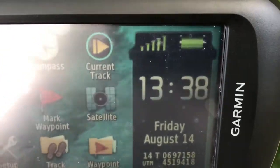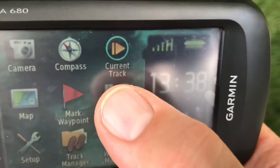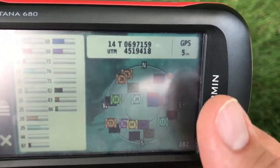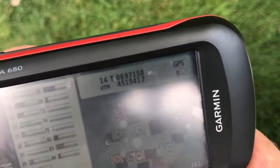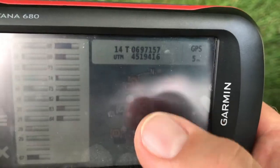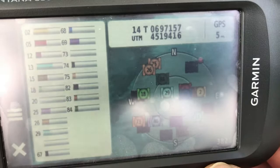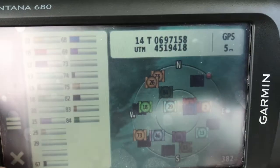It tells us our battery strength up there and it also gives us the time of day. Now if you wanted to see the satellite spread that you're currently using to get that location, that screen will also tell you your current location and show you the spread of satellites to the north and south. It always gives you north at the top. You can see there is a variety of satellites and over to the left shows you the strength of each one of those satellites — the signal that's being received. We need three or four of those to be giving us really good signal to be able to get a good location.